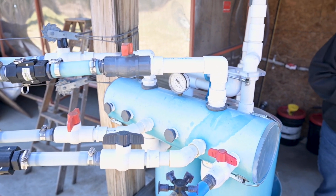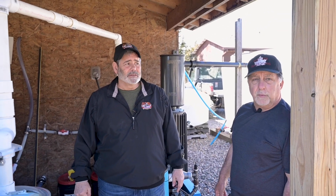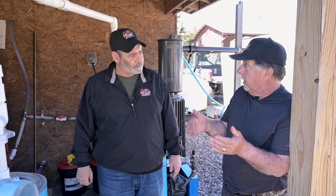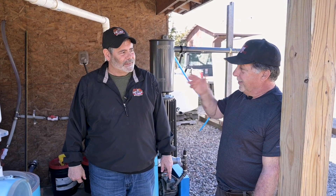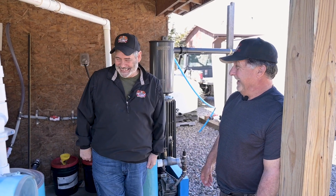We ran 26 pounds of vacuum this season — and it's always chasing leaks. Squirrels, you know how that is. That's pretty good for the season though. When you'd lose a tap or something would separate, you'd probably lose a couple pounds of vacuum. If you went from 25 to 23 you've got to go in the woods. On a nice calm day you could actually hear the leaks — I can see them.